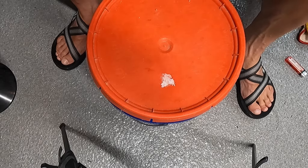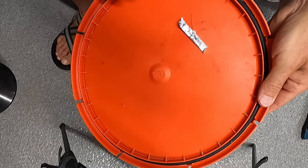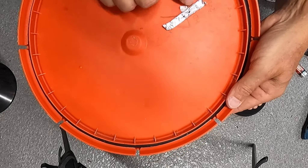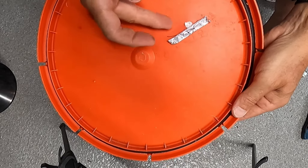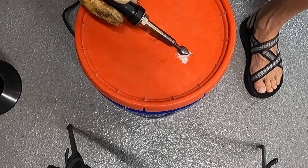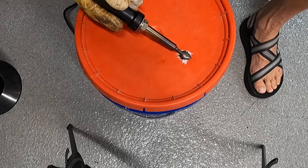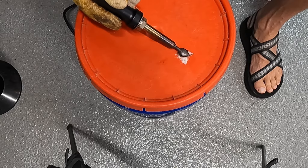Without the proper tools it's really not a work of art, but to finish it we just cut the braid off and let it firm up and dry. You can see this is going to stay on there — let me pull it off just to show you. You can see that the HDPE has penetrated all the way in. Of course, the best way is to get it from both sides, but we can't do that here. Now let's clean it up with the right tool and smooth it out.